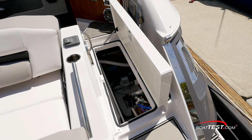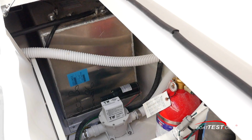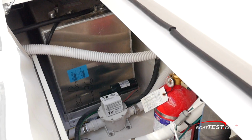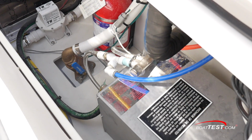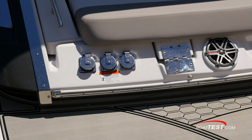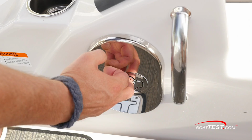The transom walkway doubles as a hatch which opens, making it easy to inspect critical equipment. There's a welded aluminum fuel tank forward, a bronze through-hull fitting for raw water cooling for the optional generator, and a diaphragm pump for the air conditioning system's cooling water. This is a handy place for the available fixed-mount fire suppression system, so it can be easily checked each year. The hot water heater is just behind it. The standard shore power outlet and TV hookups are under the stainless steel caps. By the stern walkway, there's a hot and cold shower wand behind the stainless cover.